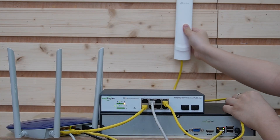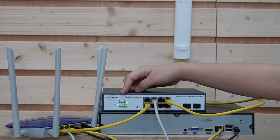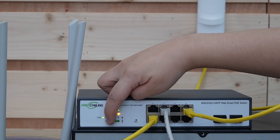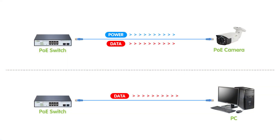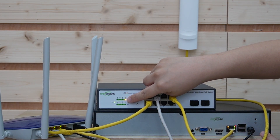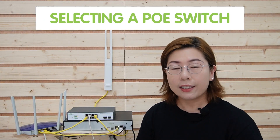As you look at the indicator lights — if you connect a non-PoE device to the switch, you'll notice the orange light won't turn on. That's because PoE technology has a power handshaking feature that only activates if the connected device can accept power. For port number 8, which is connected to the wireless access point, the orange light is on.